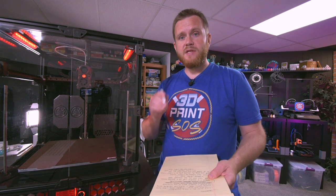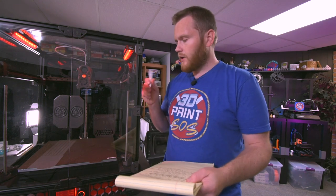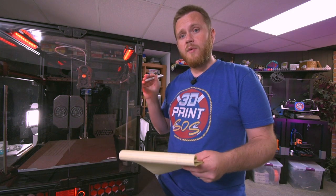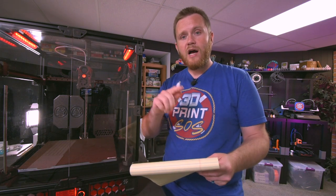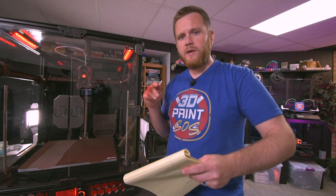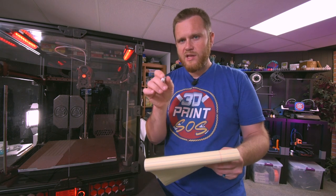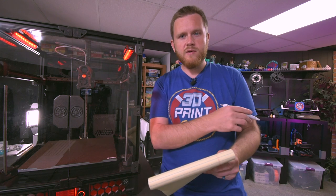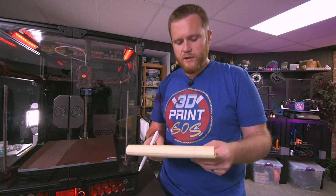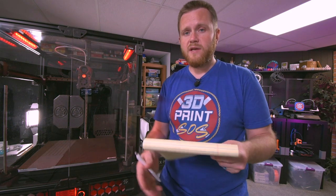So the first thing, for example, is if you want to do Stealth Burner, which I suggest because it has a little bit better cooling for PLA, I accidentally printed Clockwork 2, which is fine if you want to buy a different stepper. But if you want to just keep everything, the only thing you would need for a Clockwork 1 Stealth Burner is just a 5015 fan that's not included in the kit, because it comes with a 4020 fan for the Afterburner. So if you want a Stealth Burner, print the one that's for CW1, Clockwork 1, and that will let you use the existing stepper motor that comes with this kit, and everything else, the gears will all fit and everything will work. The only difference, outside of the 5015 fan, is you need to print those files instead of the Afterburner.